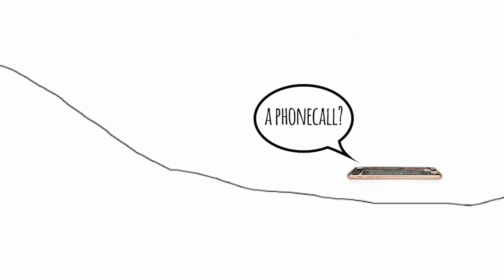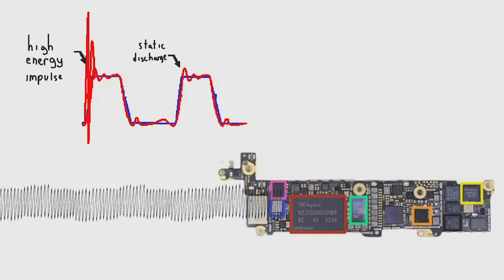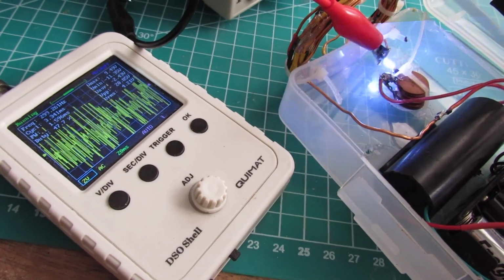Wavelength equals speed of light divided by frequency. So for example, if we were trying to mess with an iPhone and we tried hitting it with like yard-long radio waves, the waves would appear to be flatter from the circuit's perspective and it would interfere less with the voltage and could be better dealt with. But if we hit the iPhone with higher frequencies, the shorter wavelengths would induce sporadic highs and lows within the hardware's voltage and current, and this would cause anarchy within the system.